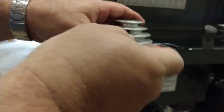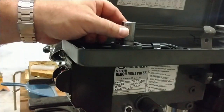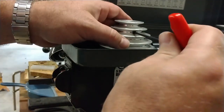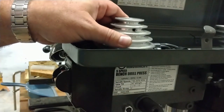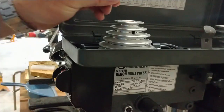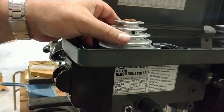The drill press comes with a three-millimeter allen key, but it's so short that getting much torque on the set screws is difficult. I'm using a T-handled three-millimeter allen wrench for the pulley adjustments. If you don't have one you can use what comes with it — it'll just be a little more difficult. I'm also using pennies as spacers — three pennies to set the height on the spindle pulley. Pretty much everybody has them, and setting them to that height will get you off the clamp. You might need to adjust slightly, but don't get the pulley so high that it starts rubbing on the belt cover.